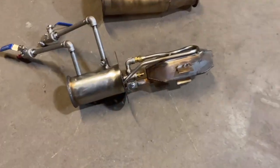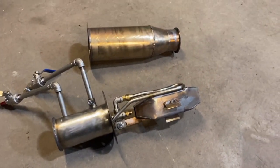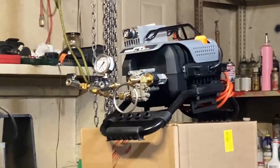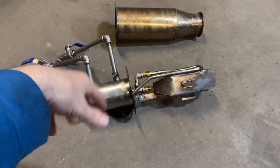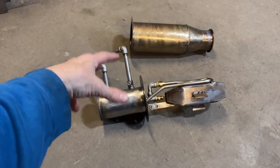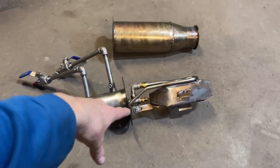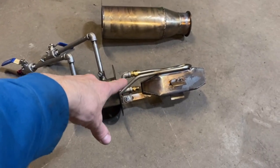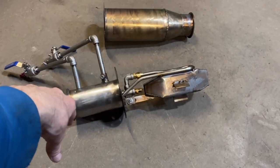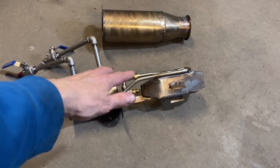The reason why we're doing this is to use the compressed air as the atomization source. We've all seen the high-pressure systems that use high-pressure pumps — something like those Delavan nozzles. They're very maintenance-laden and require a lot of maintenance. You've got to really clean that oil up good. This right here can darn near eat dirt. You can swallow particles as large as 3 millimeters without any problems. This thing can swallow it all, so you're not going to have any maintenance issues.